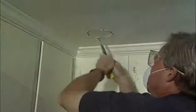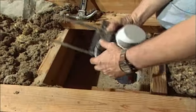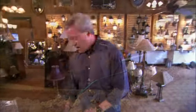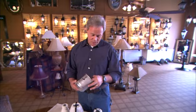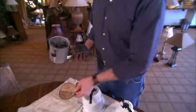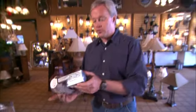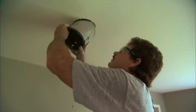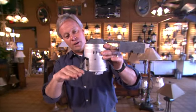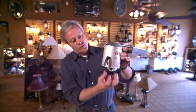In a finished room, you locate the fixtures and cut holes in the ceiling from the room itself, then mount the housing over the hole from the attic side of the ceiling, making the electrical connections there as well. Another way to install recessed lighting in an existing room is to use what we call a remodel can. This starts out with a little cardboard template — you find the location you want your light and use it to mark and cut the hole. Once the hole's cut, you pull your wire down through that hole and connect it, then fish the can into the hole where little clips slide into place to hold it secure against the back of the ceiling. Then you're able to install your trim, which is the next step.